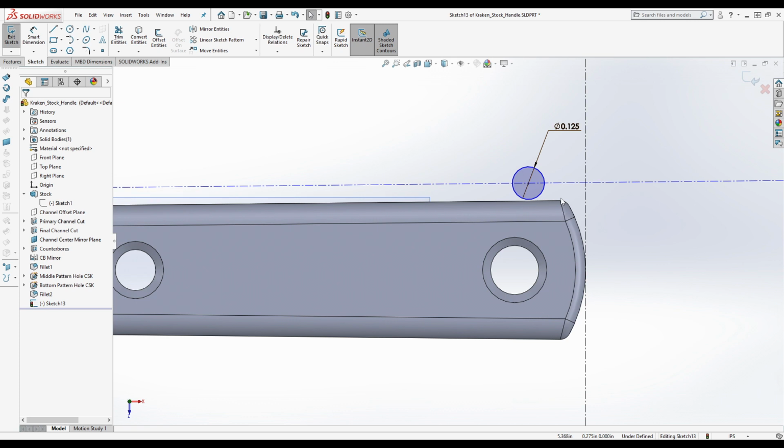I'm going to try to get a little bit farther in here just so there's less. Okay, so 0.495. Let me write that down. 0.495 and 0.4815. I'm just going to say 0.481. All right, so that is 14 thou. And that means it'd be a 7 thou cut per side.